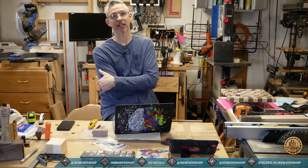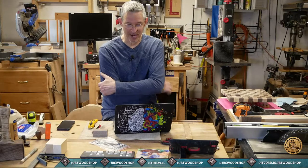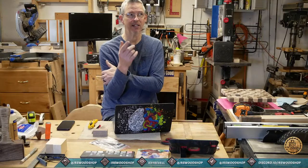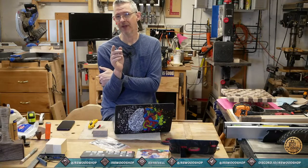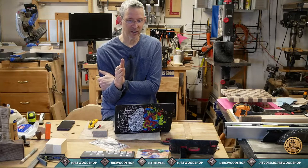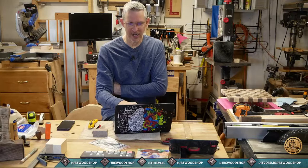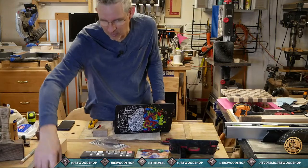That's why people love the Narex chisels, because they're really fantastic chisels that are not going to bust your bank account. Japanese chisels are awesome. I have used them. I do not own them, and they are beautiful. The thing about Japanese chisels, a lot of them, is that they get super, super sharp, but their steel is more brittle. So you wouldn't use it for severe chopping. You use it for really fine paring and things like that. That's where the Japanese chisels are really nice. But anyway, I also have some, I won't call them jank. I like my chisels.